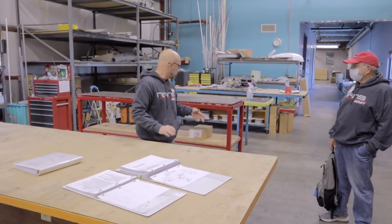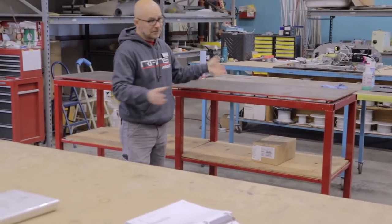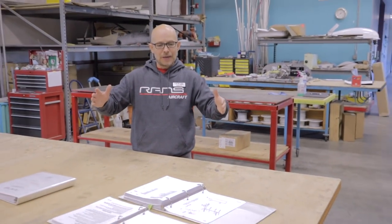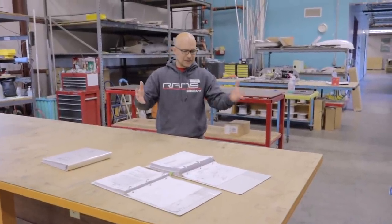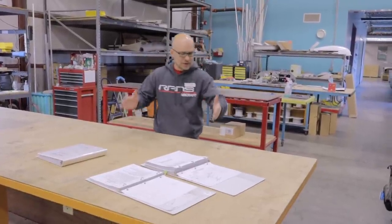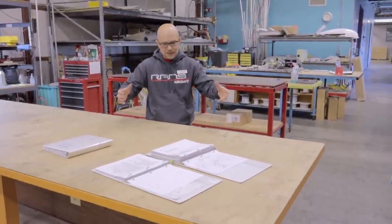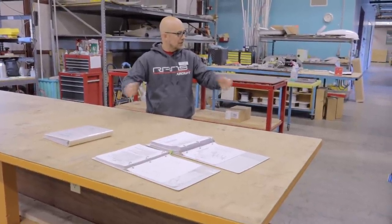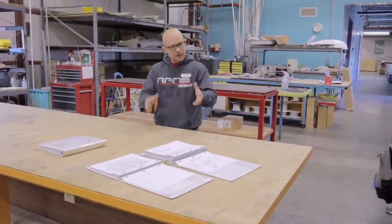This is a table that was specifically made to keep straight, and it has adjusters all around that we use to keep it very straight. If somebody wants to build a rudder there, that's fine, but I usually prefer that they do it on a table, just so that they get in the habit of learning how to verify the blocks, and sometimes I'll even do that 2 or 3 times during the build. I'll flip it over and I'll check it again. I mean, the digital protractor is there anyway, so we check it and make sure that it's straight. And once we're popping rivets, with a skin, once it's on and that last rivet is popped, it doesn't matter what, it's going to stay straight. It'll never move from that position. You can't straighten that like a fabric wing. So that is basically what I wanted to start with.